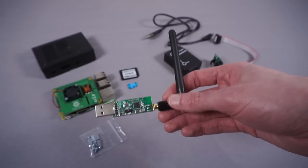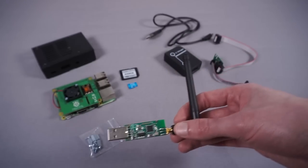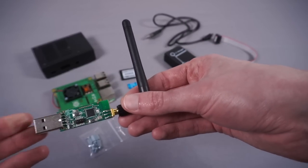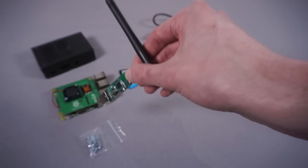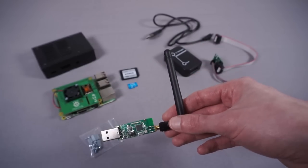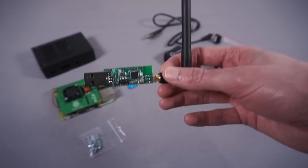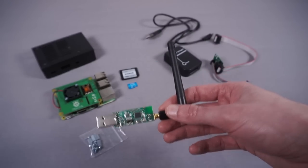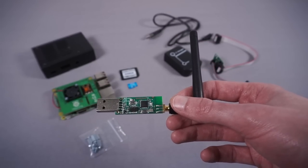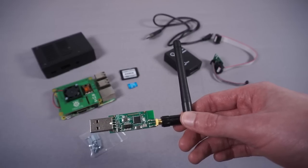With these sticks you're essentially getting hardware without firmware on it. Zigbee2MQTT provides firmware to run on your particular stick. You can buy these pre-flashed with Zigbee2MQTT firmware, which should work out of the box. But I've decided I want to program this myself for the flexibility — there are a few different versions of the firmware, and I want to be able to pick what version I want and change or update it, rather than relying on whatever version someone else has flashed.